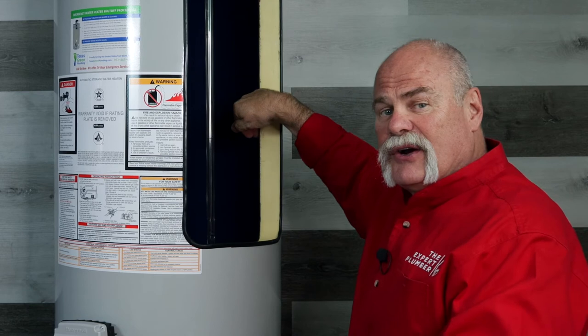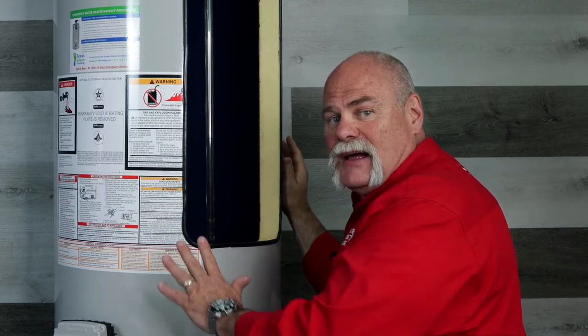An anode rod is a good thing to look at after one year and is worth replacing on your water heater — it'll actually help extend the life of your water heater. Changing it out is something a lot of people call a plumber to do, but depending on how yours is installed, it may be something you can do yourself. The water heater tank is inside, and there's foam insulation between the tank and the outer casing. Thanks to Bradford White for cutting this open — you can see how thick this insulation is. When the water inside is hot, the outside isn't, and this keeps it hot so the heater isn't constantly burning gas to maintain temperature.